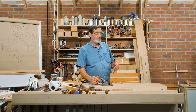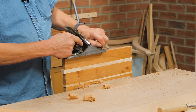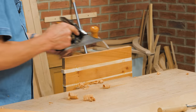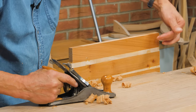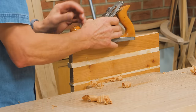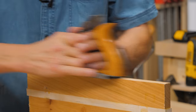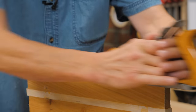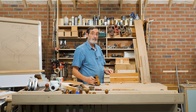When you were in school and you learned to use a hand plane, you were taught to hold the back handle here, the front handle here, and just push it into the wood. But sometimes you're pushing against the grain because the grain is rising against you. Instead of altering your body, turn the plane around and just pull it towards you until you get that beautiful clear surface — you've kept your whole body stance just the same. No problem. Get used to it, try it.